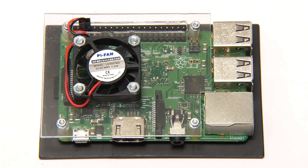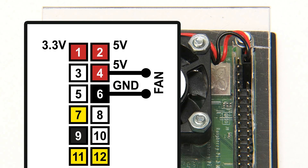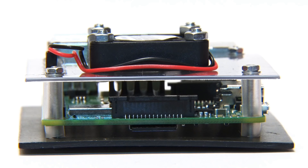The power is connected onto the Pi's GPIO pins, but to be very clear — this is not connected to a GPIO output. It's connected to the 5 volt output from the Pi and to a ground rail. The 5 volt output does not pull power through the Pi's voltage regulator; it's a tap directly from the 5 volt input from the micro USB power supply. Never ever connect a fan to a GPIO output or to the 3.3 volt pin, because that goes through the Pi's voltage regulator and you could damage your Pi. Only ever connect a fan to the 5 volt output and to the ground rail.